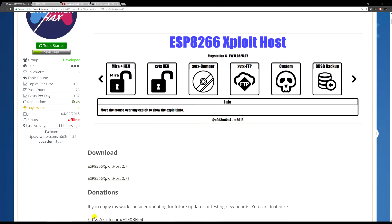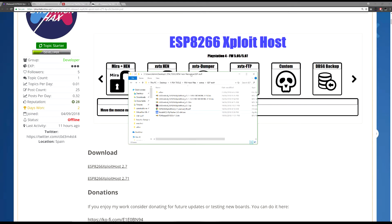I'm going to show you how to actually modify the bin file. As you can see, I've got a couple of bin files here — the original one and two modified ones I've changed recently. I'll show you how to modify your bin file. I've just reflashed my ESP chip with the original firmware so it shows you the correct addresses. I'll just wait for it to boot back up.